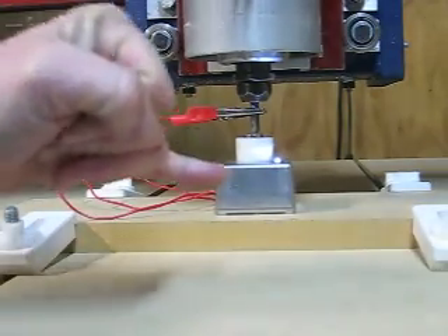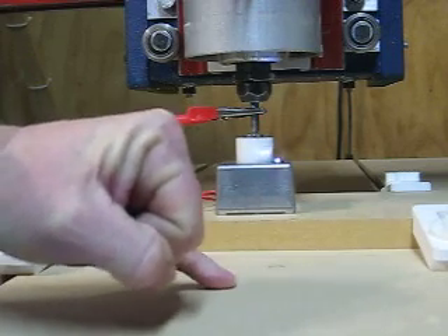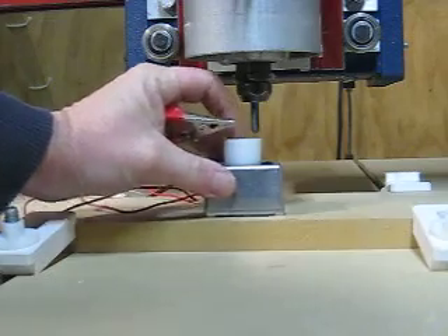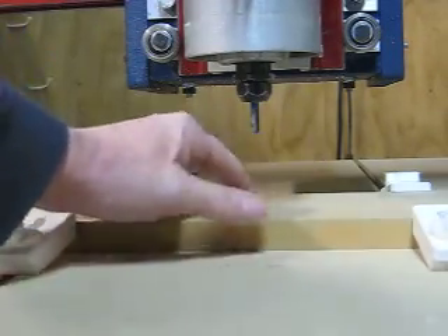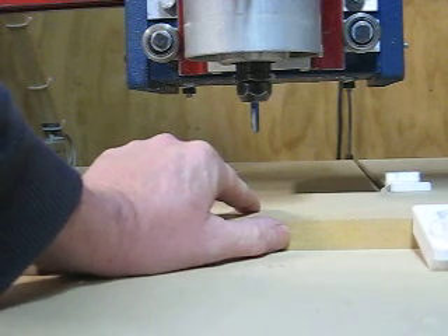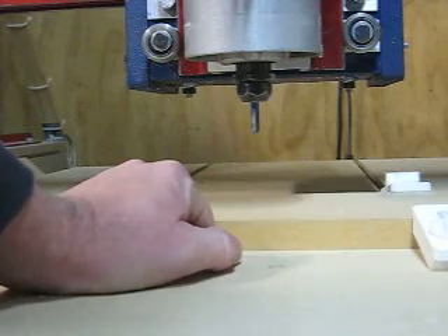It's very sensitive — I can simply touch the table with my pinky and you'll see that light will go out. That's how sensitive it is. So now that I've done that, I can push this button down just to move it away from there without scraping my cutter. And I now know that this cutter is 50 millimetres above the surface of the table.